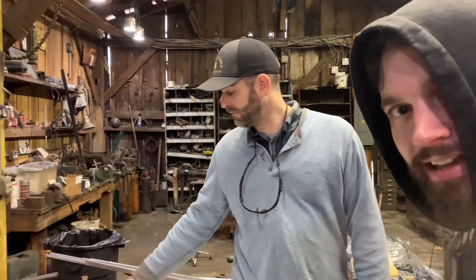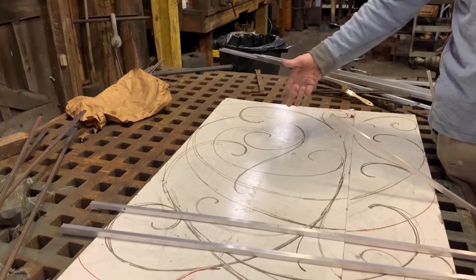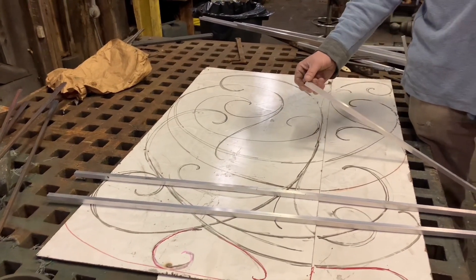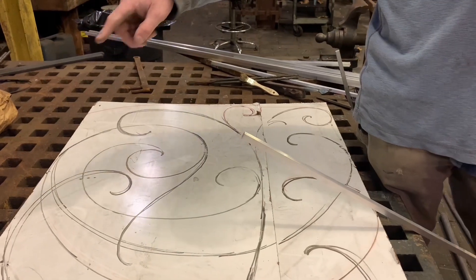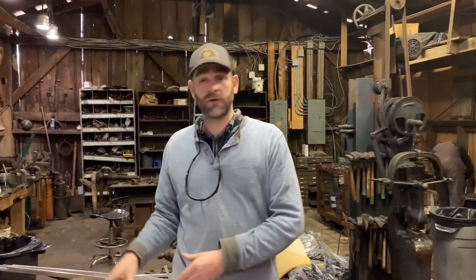We're going to start off by forging one of the main scrolls on this piece, which will require hot forging a taper on the end of the bar and then hot forging the scroll as well. Now one of the big challenges with aluminum is it never shows the heat. Steel is easy to forge because it'll show a red color, orange, yellow — it shows the color so you know how hot it is. The difficulty with aluminum is it never shows the color. When it's getting ready to go completely molten and melt off, it looks exactly the same as it does when it's cold. So how do you combat that and control the process?